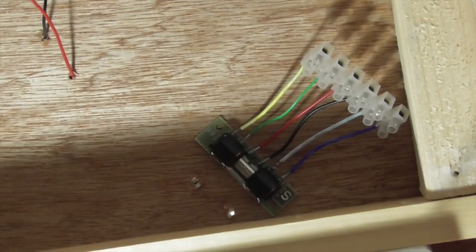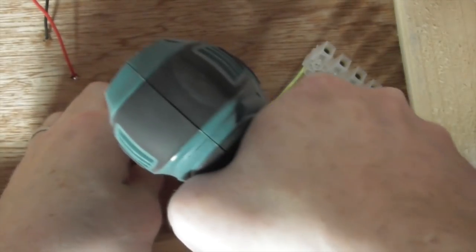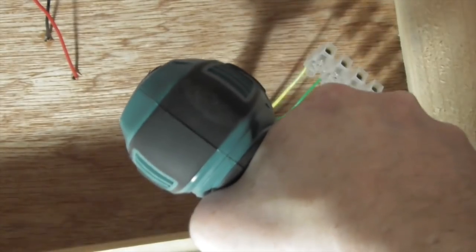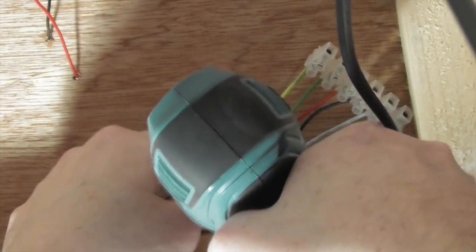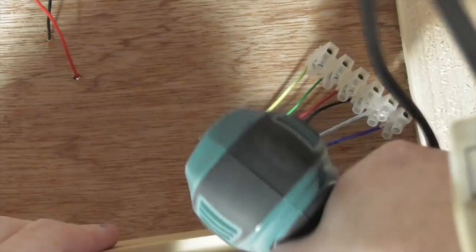So then it was time to drill. So here you can see the point motor in situ. Prior to drilling, I made sure that the point was working freely and that it had clearance on all sides. And then it was a simple case of drilling the point motor underneath, and then because I've added the chock box, it's just a case of connecting up the applicable wires to the switch and to the control panel, which I haven't actually built yet.